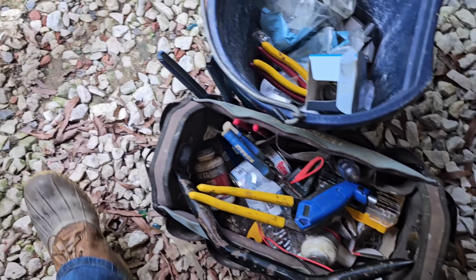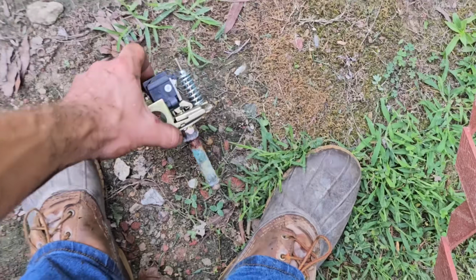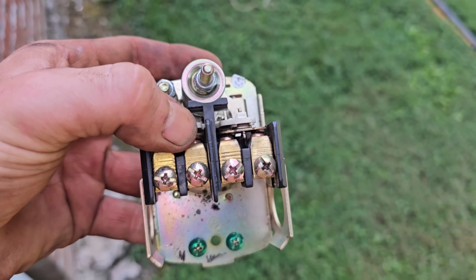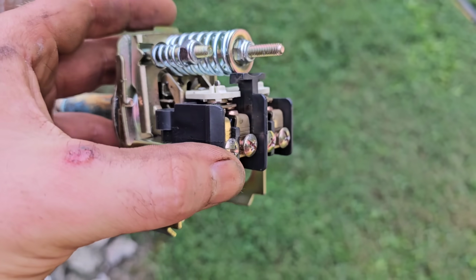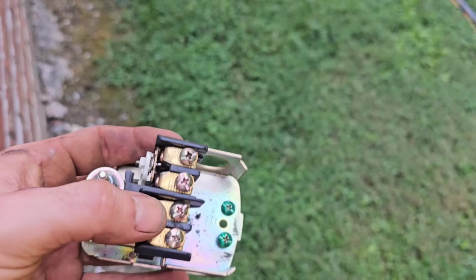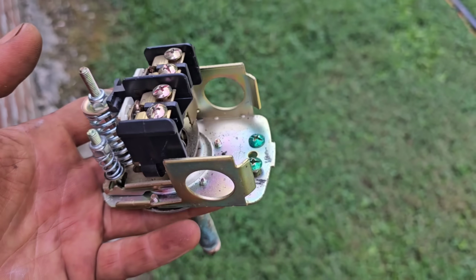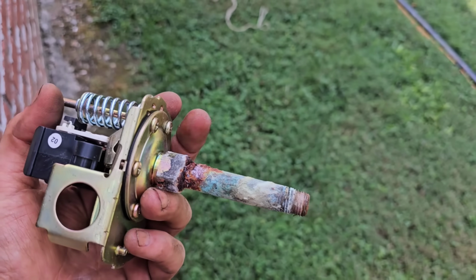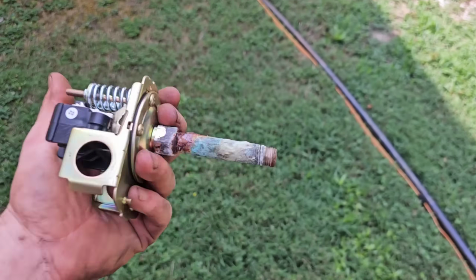So the first thing you'll notice is low water pressure, and then the system will cycle very, very frequently. When it cycles, because the tank is bad, these contacts will just sit here and flick and flick and flick. And it'll make the pump run on and off, on and off. It ends up either killing the pump or killing the wire. So it's a cascading effect.